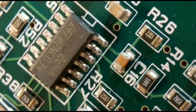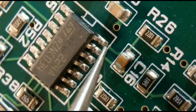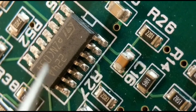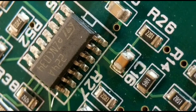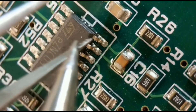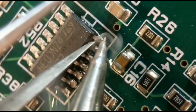Method three: I literally just tweak up each leg. By putting tweezers under the leg I lift it up about half a millimeter to a millimeter, then wick off all the solder. I'll show you how I lift the pins, wick off the solder, and then you've only got one joint to undo at the end. Run a little bit of flux along and pre-load the iron with a bit of solder. Put the iron on the end joint, get tweezers under the pin, and just tweak it up about a millimeter.